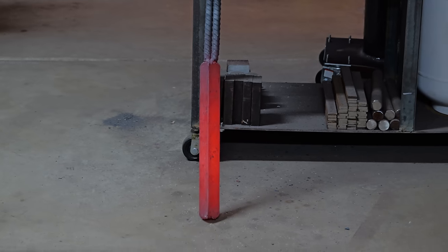After cutting the billet into four equal size pieces, it's time for another test etch. This one is pretty crucial because I can arrange the billet in any way I want — these pieces aren't exactly 100% symmetrical so I can play with the layout and create a new pattern. Because this is a four-way weld, only two of the four sides of each piece need to be cleaned up. This is one of those things that helps me save a little extra material every forge weld, and that compounds and leaves me with a lot more steel than I would have otherwise.